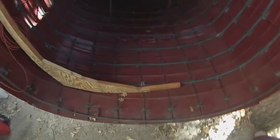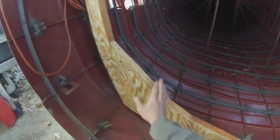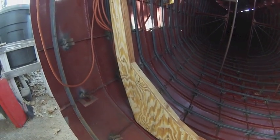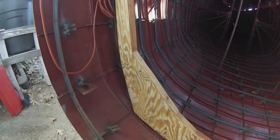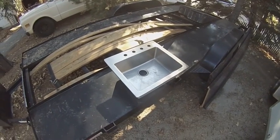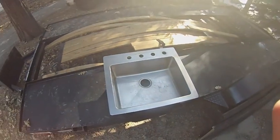The general perception is that these are wooden frames in a steel sailboat, and I call them frames also, but I see them as furring strips that might as well provide more structure to the boat and make it just a little bit stronger. My goal with everything I put in the boat is to use it to make the boat stronger, including this sink — I'll make it part of the structure somehow.